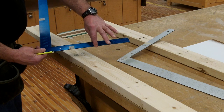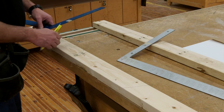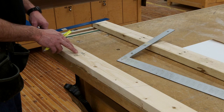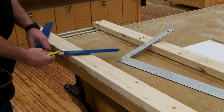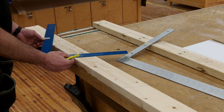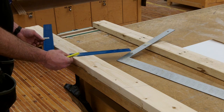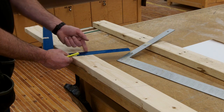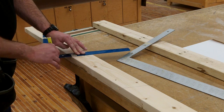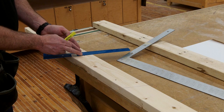Now, with the tongue being an inch and a half wide — if we have a fascia board that's an inch and a half wide included in the 16-inch projection — we want to take that off. So I simply put the tongue of my square on the correct slope at 5 and 12, slide it to pick up the pencil mark, and mark on the opposite side of the tongue. This takes off the inch and a half for our sub-fascia.